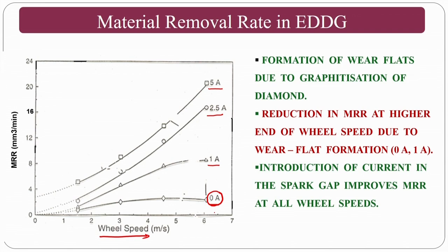In all conditions, abrasion is constant; however, melting and evaporation vary and increase with current. Therefore, material removal rate obviously increases with current. Regarding the gap current versus normal force: if you increase the gap current, thermal softening increases, meaning higher current gives higher softening and lower normal forces.